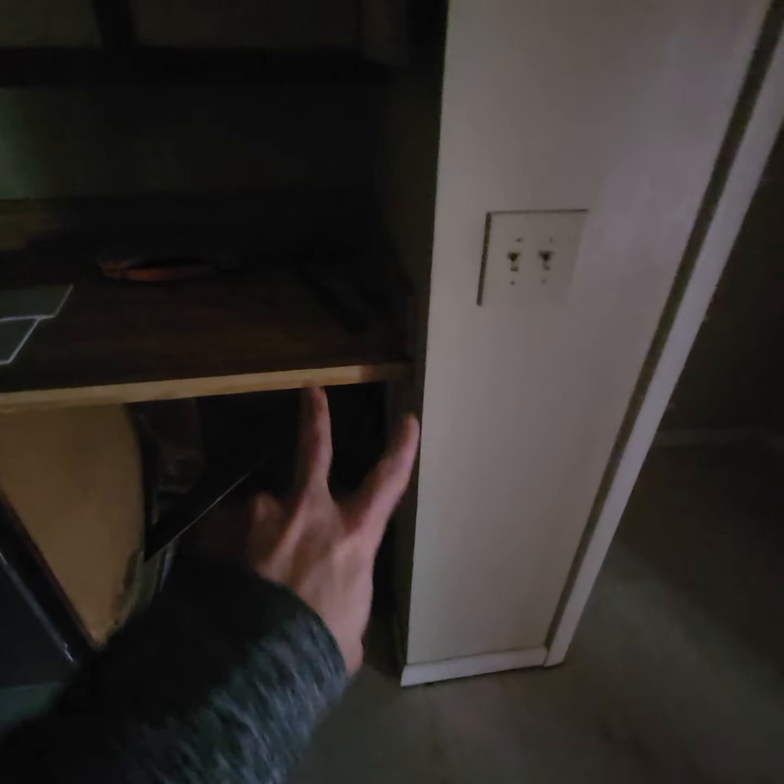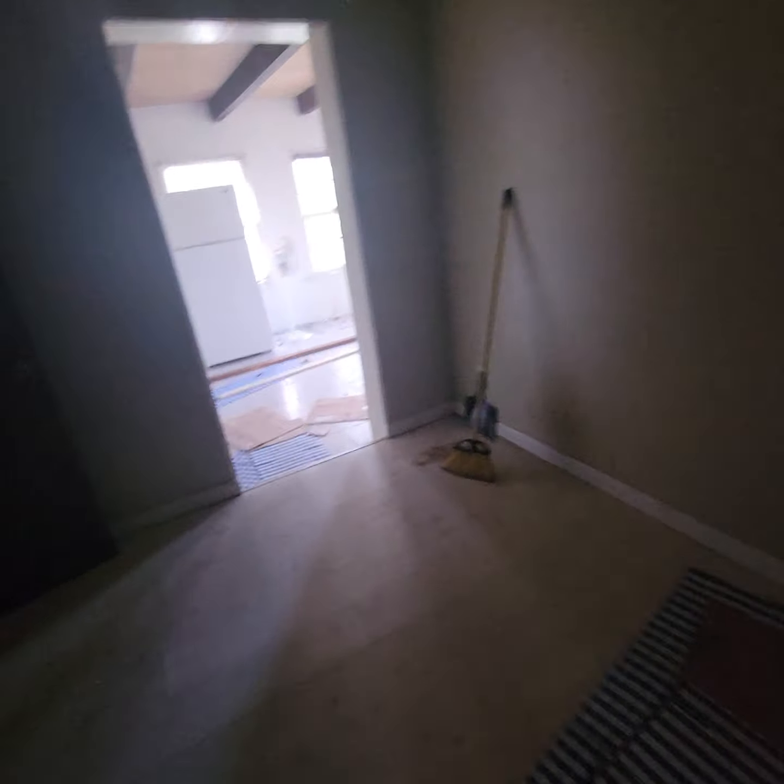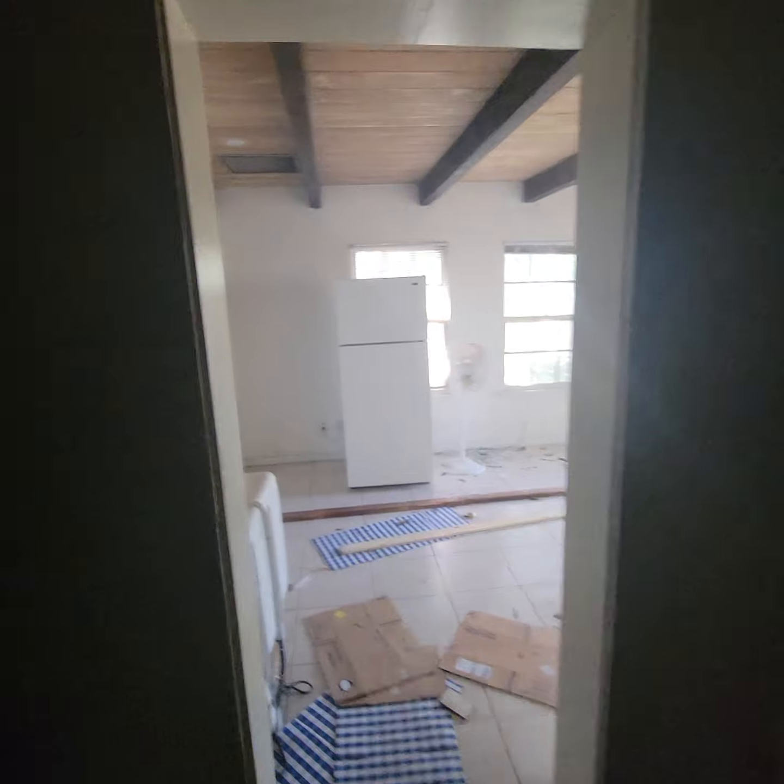Put the dishwasher back. As I told you in the text, there's little half-inch cutoff screws — you can't see anything but they're in front of your tool kit here. Those go underneath the dishwasher to screw it back in. There's a one-eighth inch board there, put that back. You need to put a two-by-four block to mount it top and bottom. Just wipe everything down — the cabinets have got grease on them, give it a good once-over wipe down. Fix handles, check drawers. Wipe the fridge out as best you can.